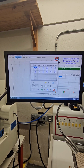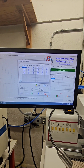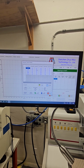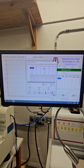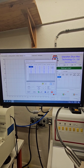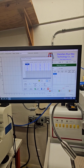The heating parameters, this is where we set up our profiles. And here you can set up to 8, up to 10 zones. You have upper temperature, the heating time, we hold it when it gets to that temperature. The rate, factory rates are 3 degrees per second. We have our lower temperature, our lower heater, the heating times, and the rates. Normally we use 1 degree per second, but we leave these factory profiles in there just for reference so you have them. Down here we can set our infrared temperature, so I'll just back up with it.